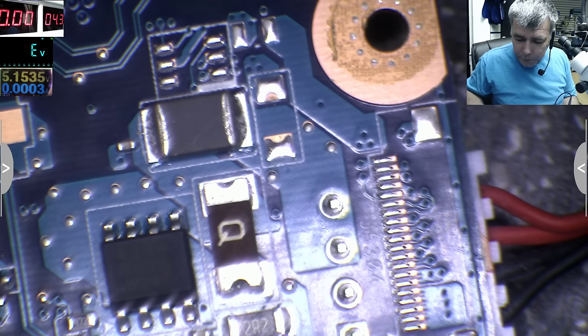So we plug the charger, the charger, non-desktop. We plug the charger. Now we'll check with the multimeter. Volts, we change the multimeter on volts. Okay, yeah. And now I will keep, because you check with the ground, compared with the ground, so I will keep this on ground, or I can keep it here because these two points are ground. Okay. I'll keep it here and we will check together from the charging port, and the charging port is soldered here. So check on the multimeter, you have 19.2 volts.